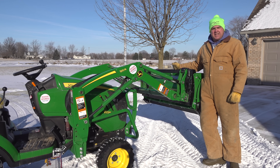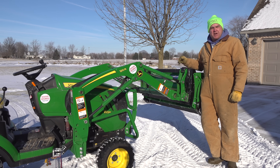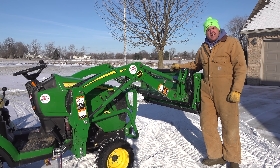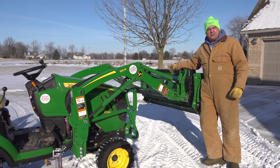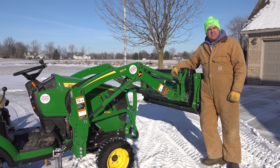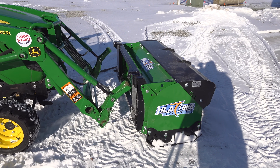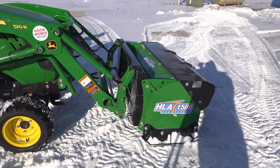That's not a lot. To me, if I'm going to spend this kind of money on a tractor, I want all the lift capacity it can give me. So it's very important on these subcompact tractors that you trim every pound you can, yet maintain the attachability that you bought your tractor for. So rather than considering the JDQA as a proprietary system where the manufacturer is out to get you, I think you should consider it a specially designed Quick Attach system meant to maximize the potential of your little tractor. And it does so — you can see it in the numbers. It's just as easy to hook up as the SSQA, and overall you get more functionality.